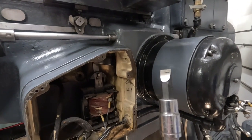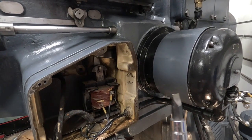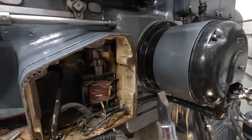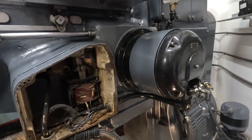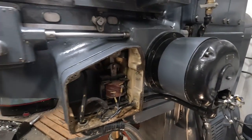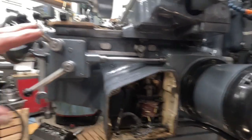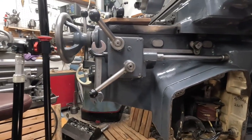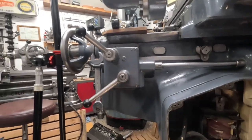These are some of those half-inch drive screwdriver-type things — I don't know, ten bucks for three of them at Harbor Freight. I took and hollow-ground them on that little Weber bell grinder, which is really, really handy. I managed to break all those loose without deforming the heads at all. When I've had to take these screws loose on this thing, I would hollow-grind a screwdriver — that means you back it off so the tip is just a little thicker at the very tip. It gets in there and it grabs the bottom of the screw. It really works.